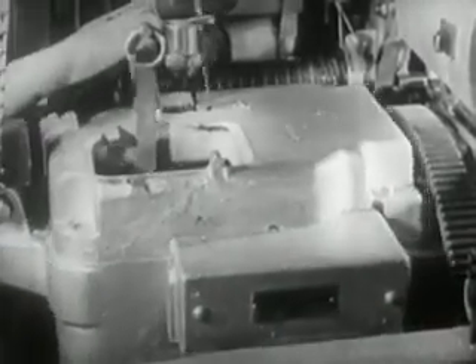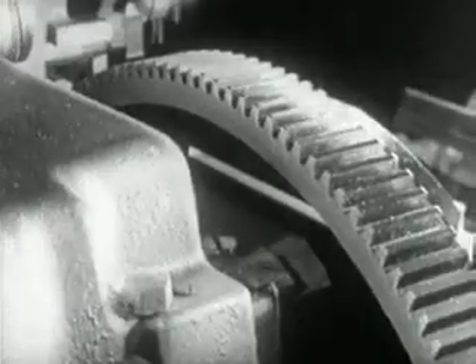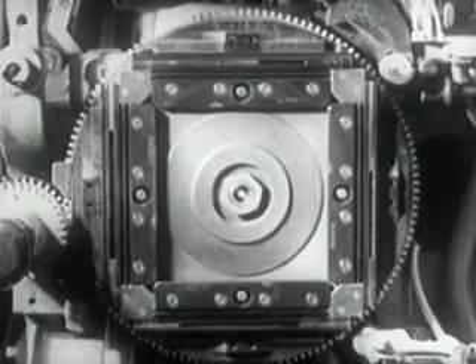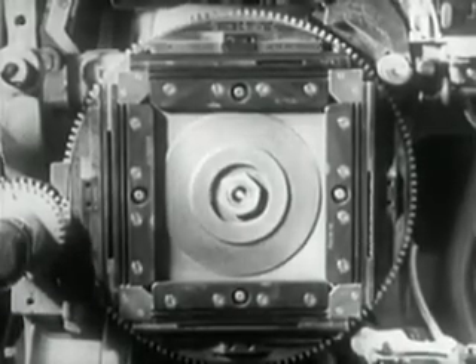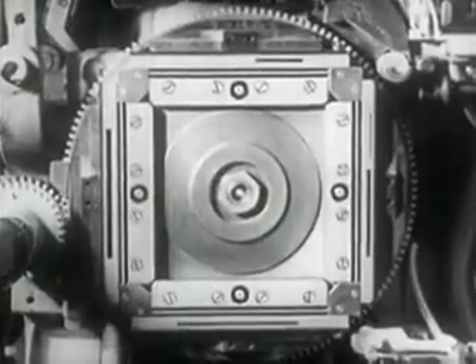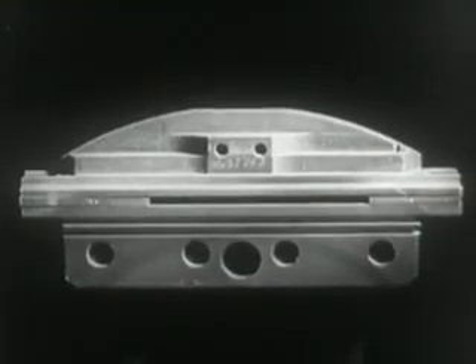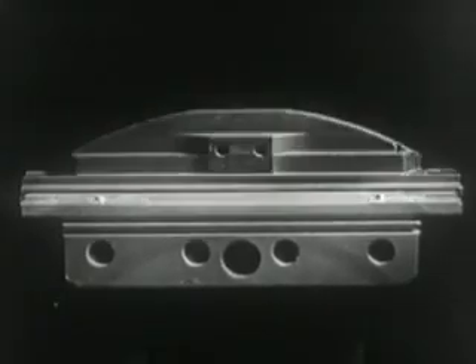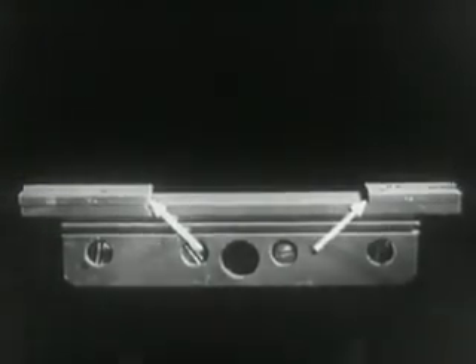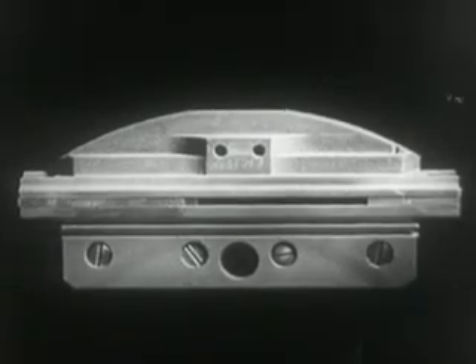The metal pot is always kept heated so that it is ready to cast slugs each time the mouthpiece moves forward and locks against the back of the mold. The mold is mounted on a rotating disc. The disc has teeth which are geared to a pinion activated by two sections of gears so that it rotates at intervals. Normally, the wheel carries four molds for casting. The mold is made up of the following parts: the body, fastened to the disc with four screws; the cap; and between the body and the cap there are inserted, depending upon the production needs, the precision liners — constant length at the right and variable length at the left. The liners determine the length and the thickness of the slug.